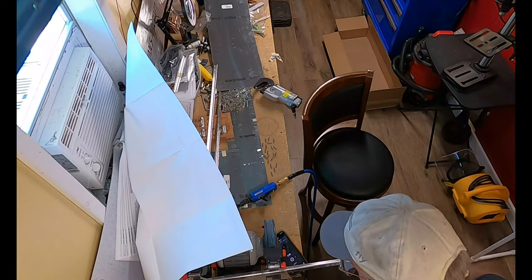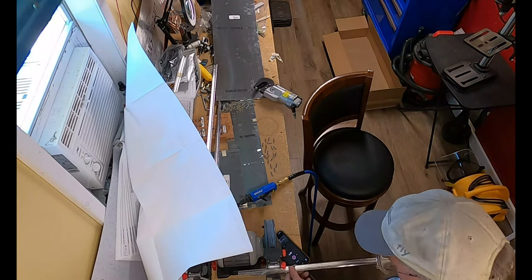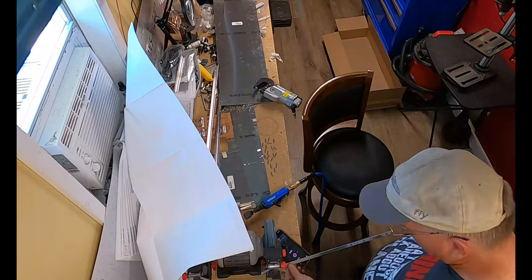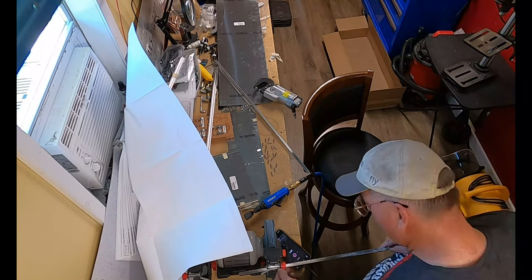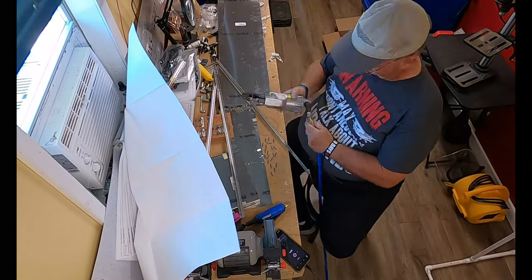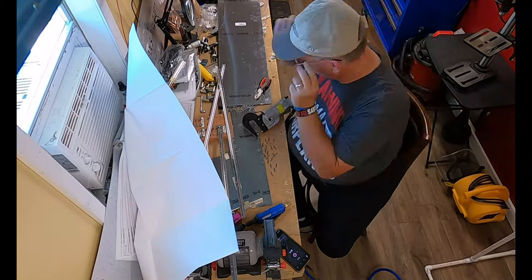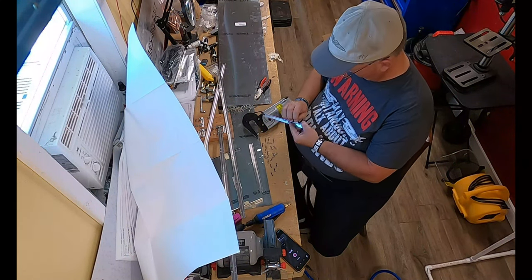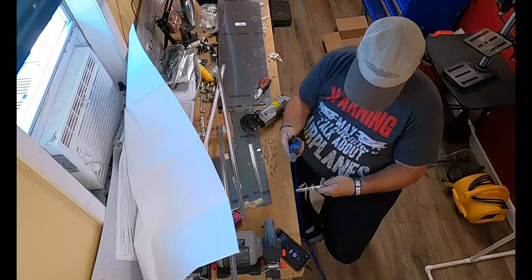So what I would have done is dimpled the nut plates and also the areas of the rail that they go onto, but I would not have riveted the nut plates on until after the rail itself had been installed, because once again, it's all about trying to make things a little bit easier for yourself. Speaking of easier, you saw me rounding off the corners there on the, it's not really a grinding wheel. It is a 3M deburring wheel that I have installed on one end of my bench grinder. Let me tell you, that thing works like a charm.